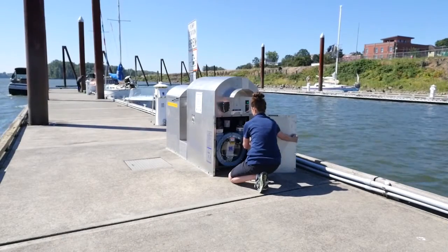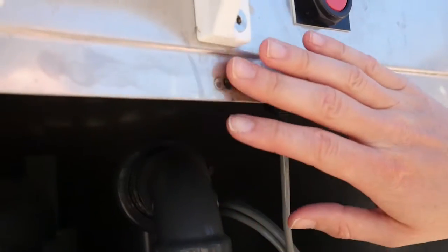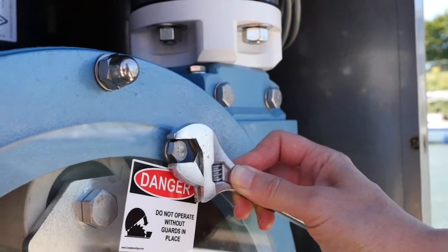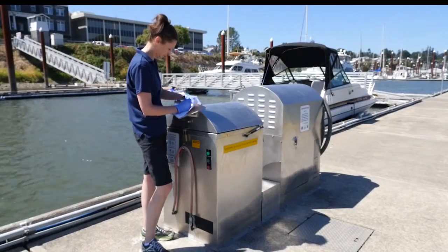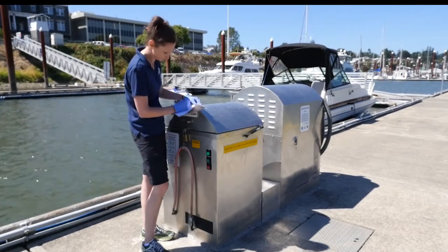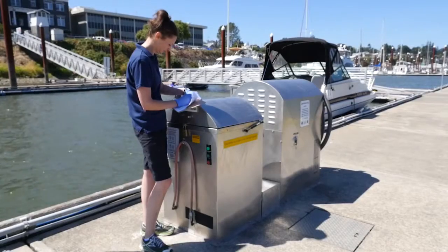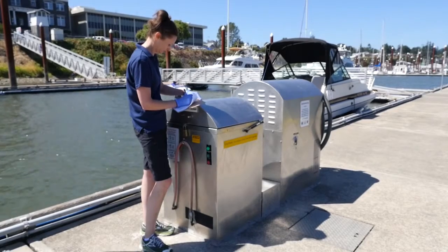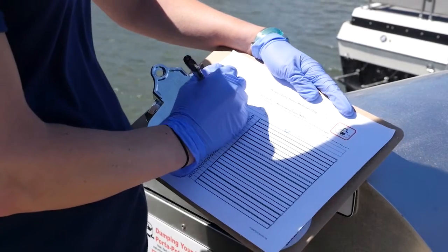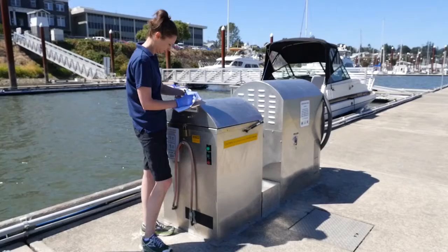Take the cover or external panel off to look at the pump and connected plumbing. Look for any cracking, corrosion, or rust. Perform a fastener check, tightening any loose nuts or bolts on the equipment. Take a current inventory of parts and replace those that are missing or breaking down, though you might be doing this throughout the year. Document any issues, the date you replaced parts, and any parts that you purchased to maintain supply inventory. Completing the inventory form will provide documentation to compare past and current conditions, prioritize repairs, and establish a programmed approach for consistent long-term maintenance and replacement.